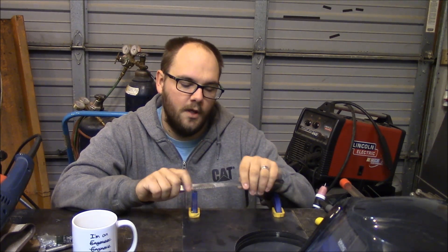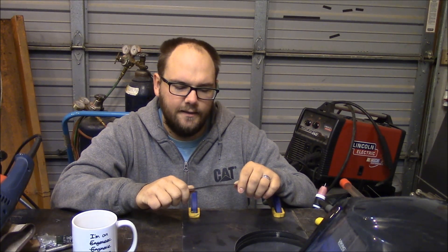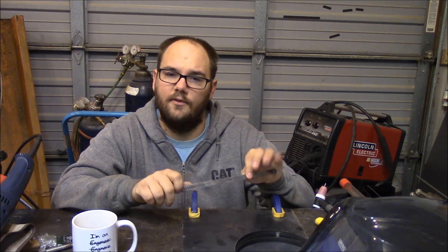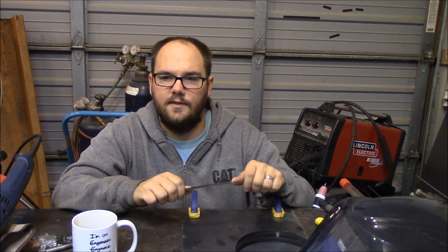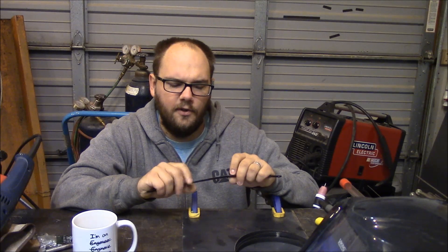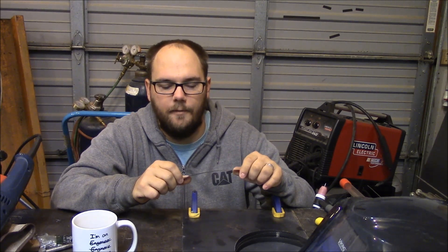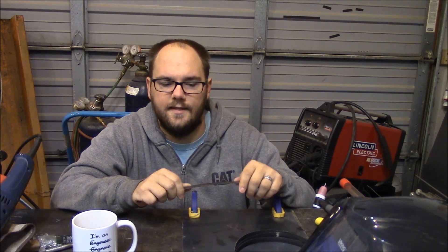When TIG welding, you clearly need to add filler metal - without it there's no reinforcement and it'll be a weak spot. So what kind of filler metal for high carbon steel? Whether it's high carbon or bimetal, it's still high carbon steel for the most part. The answer is I'm going to use 309 stainless steel.